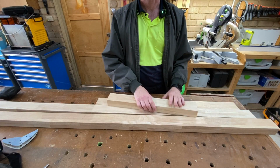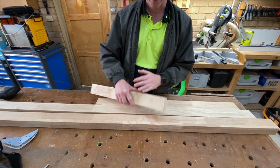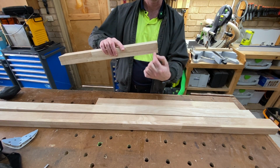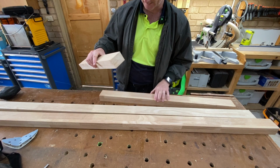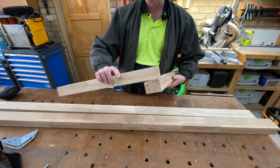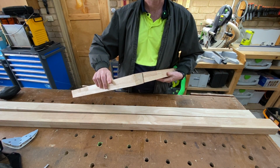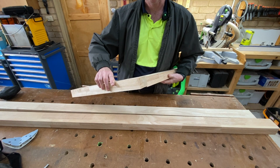46. Just very quickly, a lap joint, or a half lap joint, is where you cut out a section of timber halfway through the wood on one piece. Do the same on the other, and when you then connect them, usually at 90 degrees, although you can go straight, they end up being the same width but lapping over each other, hence the name lap joint.